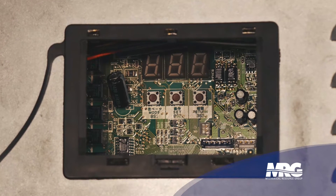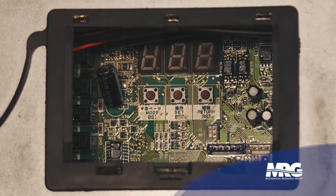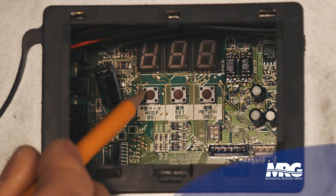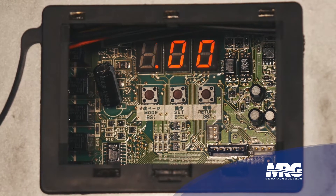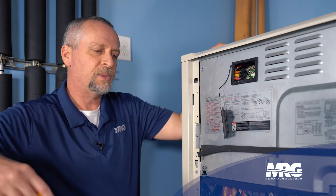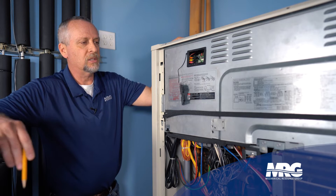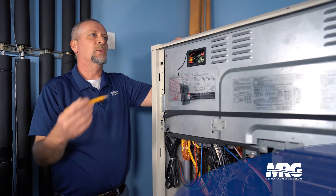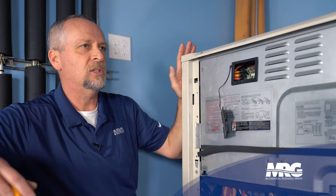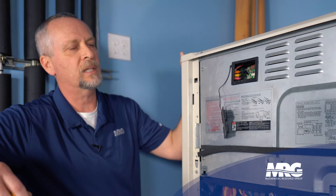On the main printed circuit board, the A1P, I have these three segments that are not lit up right now. There are three buttons underneath those: the mode, set, and return button. I'm going to press and release the mode button, and as you'll see, it flashes 1-00. There are two setting modes. Setting mode one is a view mode — I can count how many indoor units and branch selector boxes are connected, scroll through and see settings, but I can't make the unit do anything. I'm just viewing how the unit is set up.